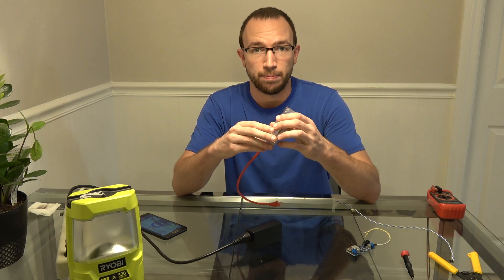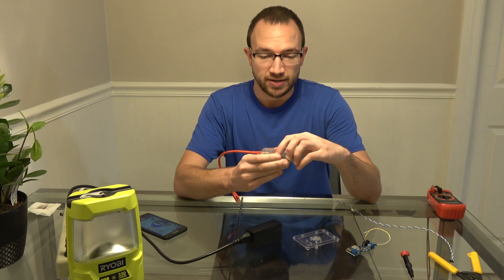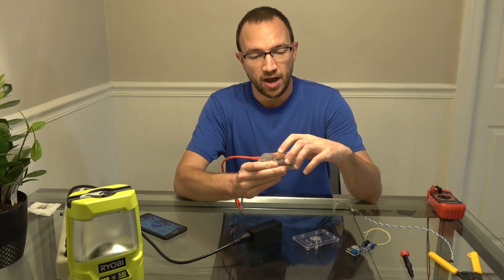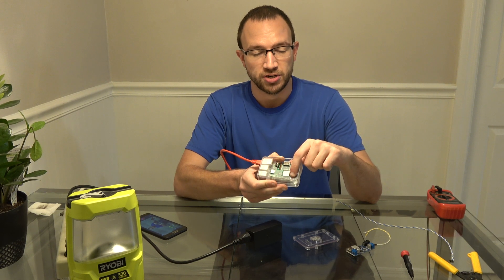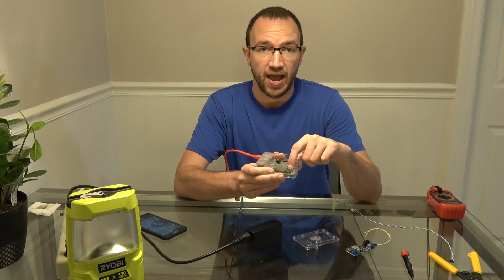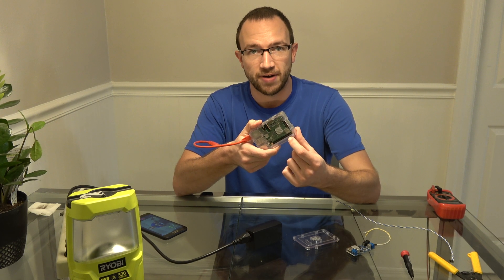This Raspberry Pi is a 3B Plus with the four pins on the GPIO right off to the side of it, and that is where we are going to be getting our 24 volts from. Our connection to 5 volts on this board is going to be through the 5 volt portion on the board, which is the same way that the official PoE hat uses. It's the bottom three pins down here — positive 5, positive 5, then ground.